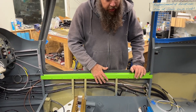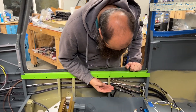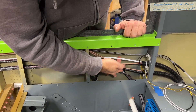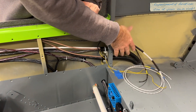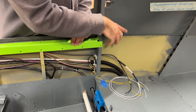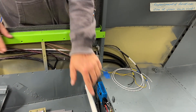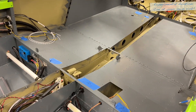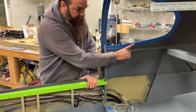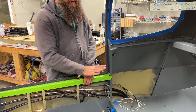We've been really careful to separate electrical stuff from signal stuff so that they're not running right next to each other. You'll see some of the antennas here and the static tube. These are the headset jacks for the rear passenger seats — we think we're going to put them right here. We'll probably make another 3D printed little bracket to figure out where they go. We have two tubes on this side, two on that side, and also a tube on each side of the tunnel. If I was doing this again, I'd probably add one more tube on each side — these are pretty stuffed and basically full.